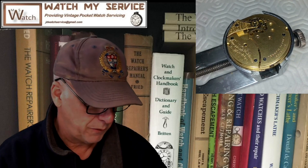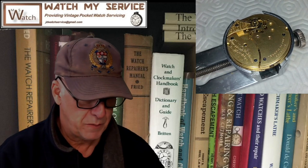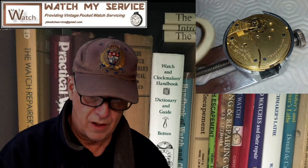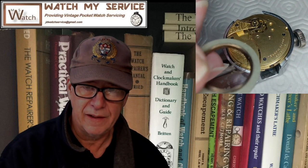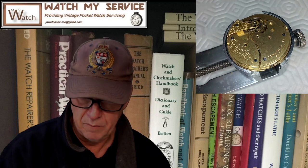The good news: I woke up this morning to check how this thing was running, and from a 180 to 190 degree swing I now have a 360 degree swing on the balance. That's with the existing mainspring. I did some mainspring hunting and found some comparable replacement mainsprings, but I don't think it's necessary — the mainspring that was in there was a bit set, but not that bad.